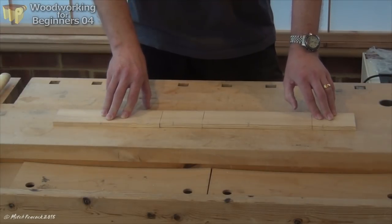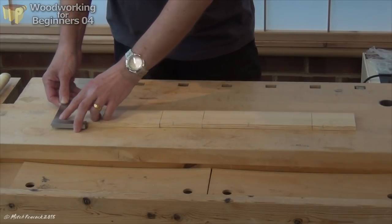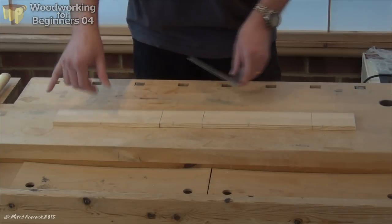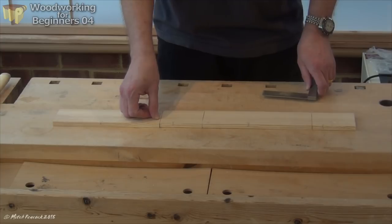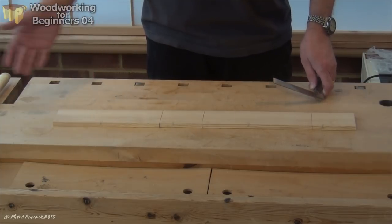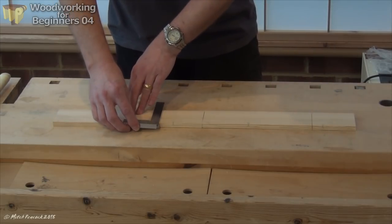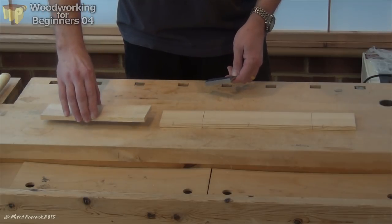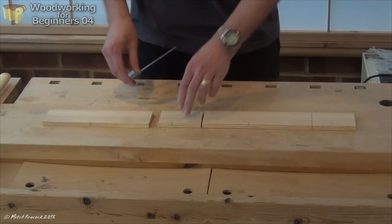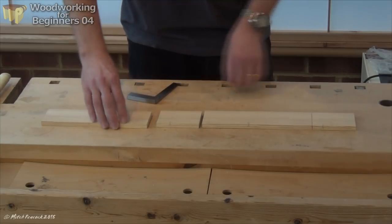Now how do you break down a board into the pieces for your box? Use a square on the face edge, first mark a square end and cut off the waste nice and square. Decide how long you want the box to be and mark that — you don't have to measure it, just mark the length; it could be a hand span or anything else. Knife that and cut nice and square, so you've got one long side. Now determine how long you want the end to be — these are all external measurements. Again, you don't need to measure it, just decide, mark it off, and cut it square again. So you've got one side and one end.